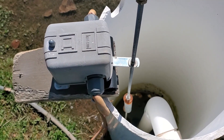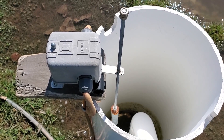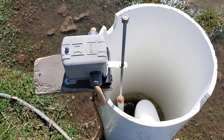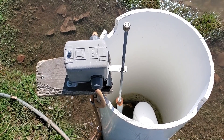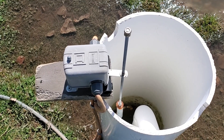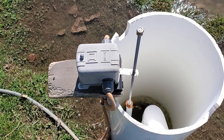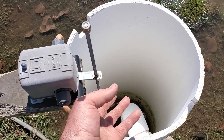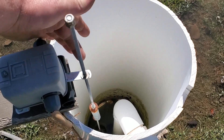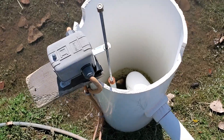This switch came off of Amazon — I'll put a link to it in the description. It's called a tank fill switch. There are two different styles: one that turns the pump on when the tank is full, and another that turns the pump on when the tank is empty. The one we have here turns the pump on when the tank is full, so when the water comes in it raises the rod, takes the stop away from the lever, and then you can manually turn the lever on to start the pump.